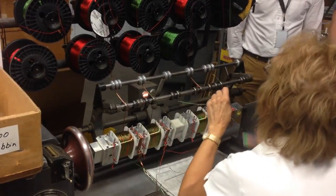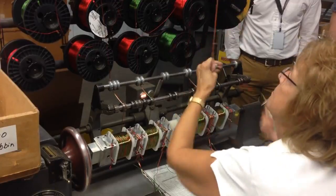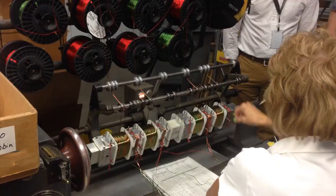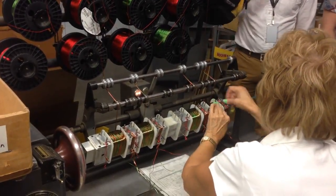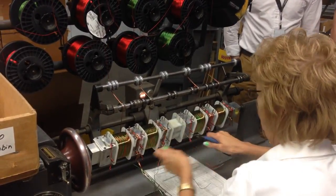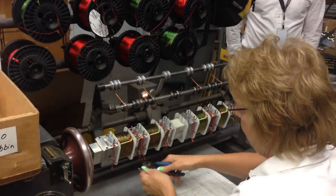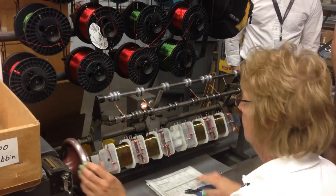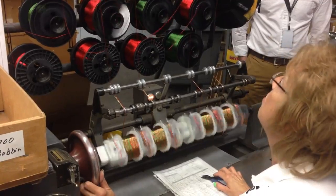In the case of the 601, it's fully balanced. When you get high current from an amplifier, there are a lot of stray fields inside there because you're exciting everything — the aluminum, the steel. That stuff causes fields and noise that can be canceled if you have a positive going and negative going. So one half of the amplifier is negative going, one half is positive going. From input to output, it's going to be negative going. This allows us to achieve a signal-to-noise ratio of 135 dB.